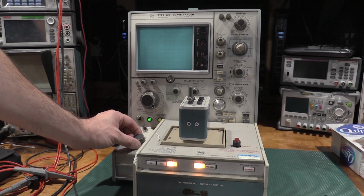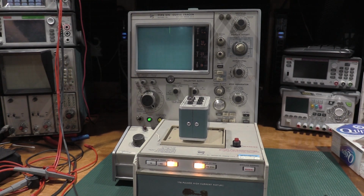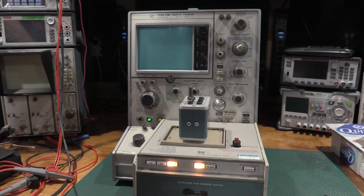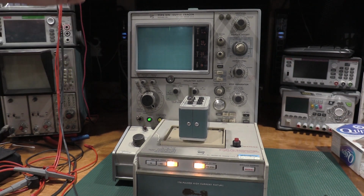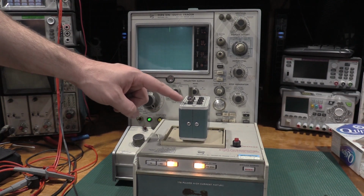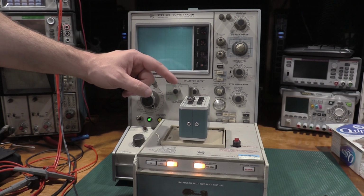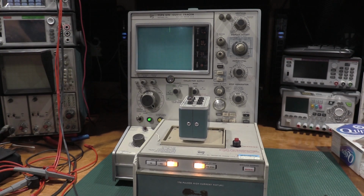What I was supposed to do, if we take a look at the display, if I wind up the current here, there we go, there's the trace. As it intersects the top line, I should be plus or minus 2 divisions from the top line. No big deal. This is correct, except for the fact that I'm using the 2 amp per division resistor as opposed to the 0.2 amp per division resistor.